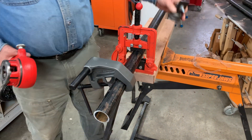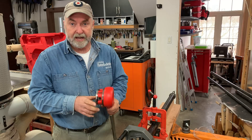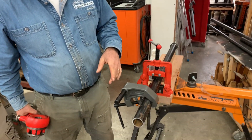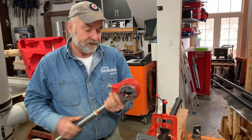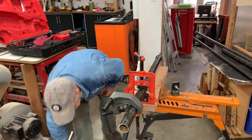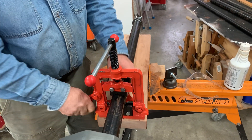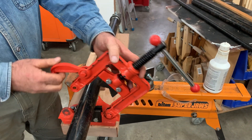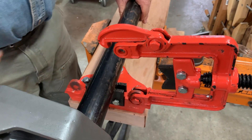This is inch and a half black iron pipe. I've been threading this stuff for years using tools like this — it's just a hand tool, a ratchet-style thing where you turn it and ratchet it back. It works fine but takes a long time and it's hard to hold the pipe with all that leverage. One thing that helps is this pipe vice. It's not a fancy or expensive one — made in China, cost about 50 or 60 dollars. There are much more expensive ones but this one works fine. It opens up with serrated jaws that hold the pipe.